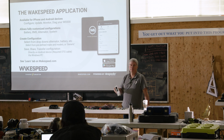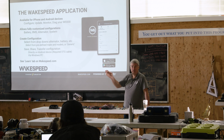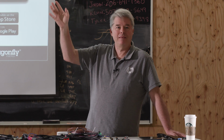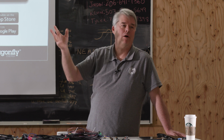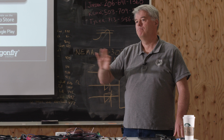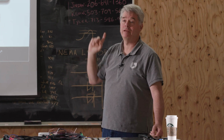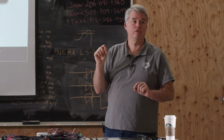The reason why is, remember we said lead acid batteries are pretty forgiving. So those dip switches saying you're somewhere between 250 and 500 amp hours, well, when we make that tail current decision, we'll be in the ballpark. We'll probably be okay. If you're doing a lithium ion battery, you can do the dip switches, but I'd recommend not. I'd recommend going to this because we want to be more precise.